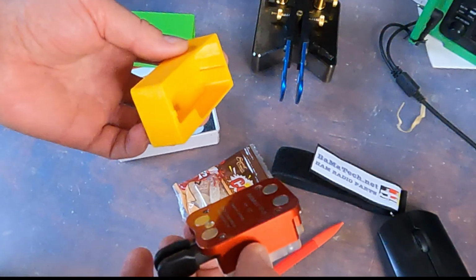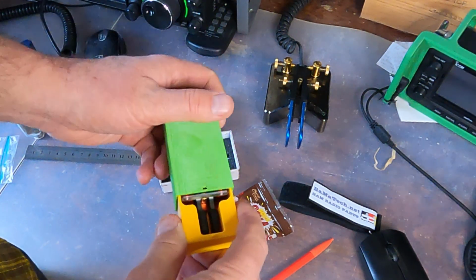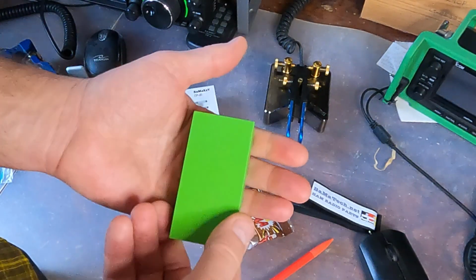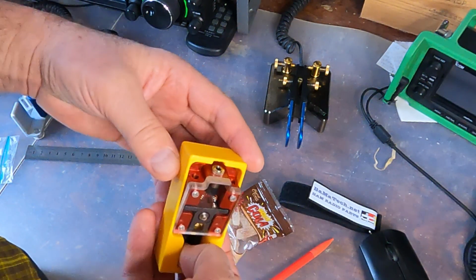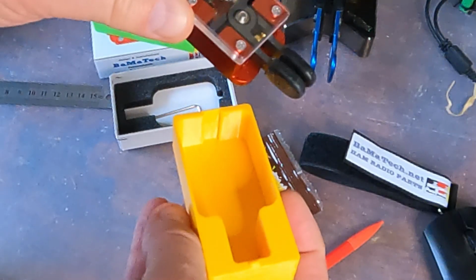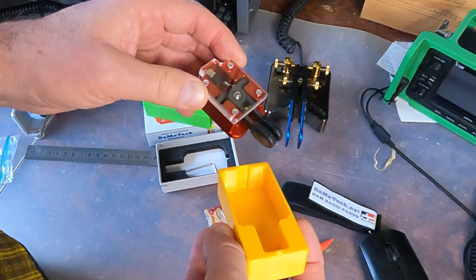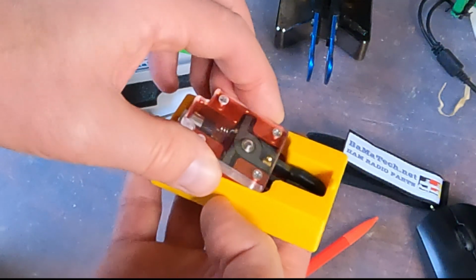That's what I did. This 3D printed box is more rugged and more convenient to transport, and probably safer. This box goes into another box, it clicks, and so here you can transport it easily and nicely. It's bump proof, and very good. It goes in smoothly and nicely. What I noticed, at least on my printer, is that I had to make the dimensions of the box 1% bigger in the 3D printer slicer program, so you can adjust the dimensions slightly. A 1% bigger box is what makes it fit smoothly.